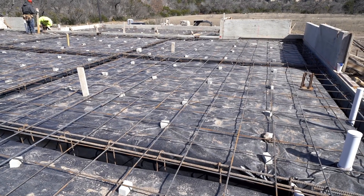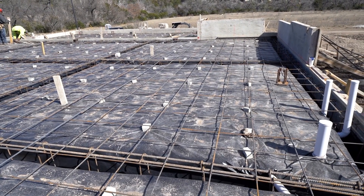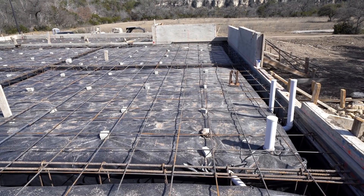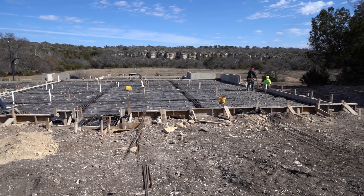The concrete thickness is 4 inches on this one. We're going to pour 3,000 straight mix because it's going to be stained. You don't want fly ash if you're going to stain it. The interior support beams are really what give you the strength, and that's why you need a lot of them.